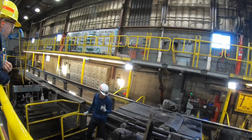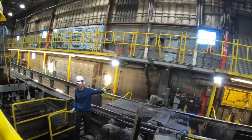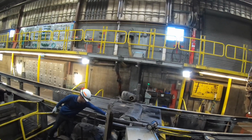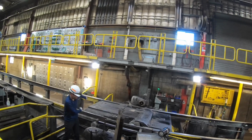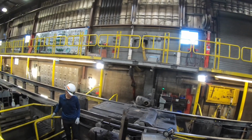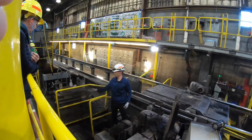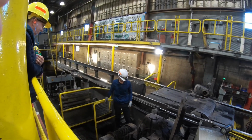And that is actually right behind me. This is what we call our wheel turn. So basically we pull the locomotive on using these cables, spot it, putting the wheel right here, and then we have this cutting head which will come up, these rails will move out, and we'll come up and reprofile the wheel, actually cut it. So you can actually see these are what used to be a wheel, all these little shavings. These are razor sharp.